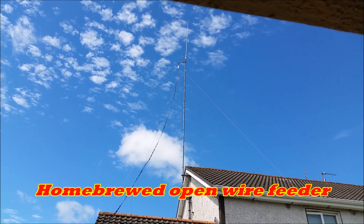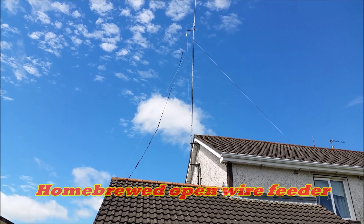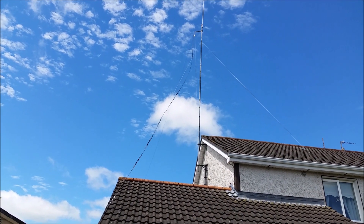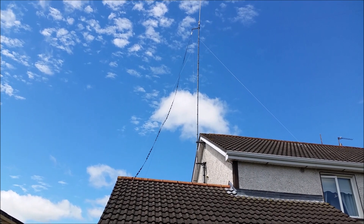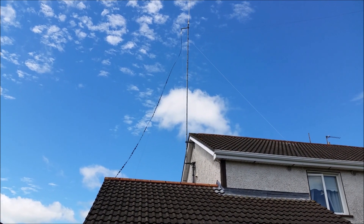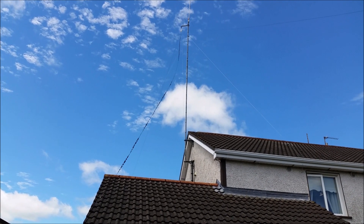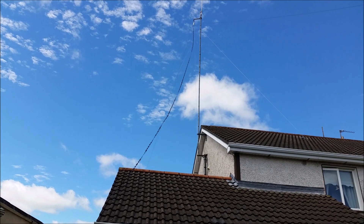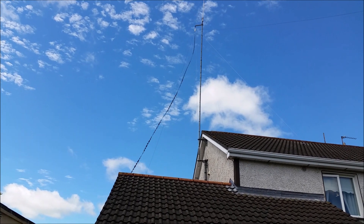A week on antennas — not a bother on it. What I'm gonna do is, I've been recommended to get rid of this 450 ohm and go to a three-inch open wire, which is pretty much the same thing. It has an impedance of around 450, 460, maybe 465. This 450 ohm is quite old and, as you can see, it's dancing around the place like a good thing and it's joined in three places — so we're going to get rid of that and put up some open wire which will catch a little bit less wind.